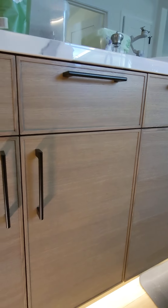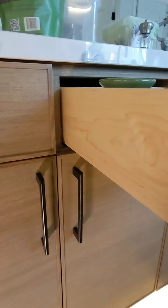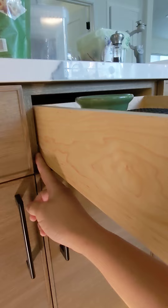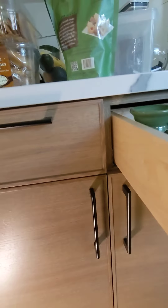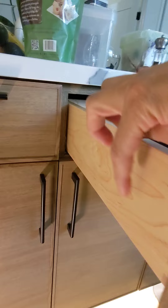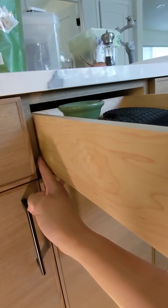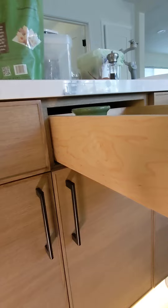Hey, what's up? Eric here. I'm going to show you a quick tip on troubleshooting drawers that are rubbing. On a lot of frameless or face frame — doesn't matter actually — on a lot of the undermount drawer glides, sometimes you see this little line here on the side of the drawer, and that's one of the indicators that your drawer glides are basically loose and rubbing against the drawer box.